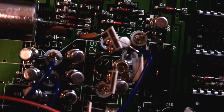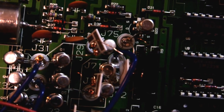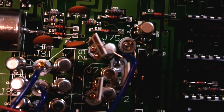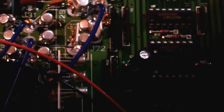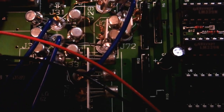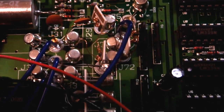Look at this. They have manually handmade these tiny little ceramic substrates. I don't know if there are any components on them or if they're just used to connect those magnet wires to. And then they've got this extremely thin magnet wire which comes off those ceramic substrates and connects either to the board, or some of them are connected, and this is hard to handhold, I apologize, to like this ceramic standoff or Teflon standoff. So yeah, ultra high impedance construction techniques in here, but I've never seen this crazy fragile thin magnet wire and then these ceramic substrates with the little coils.